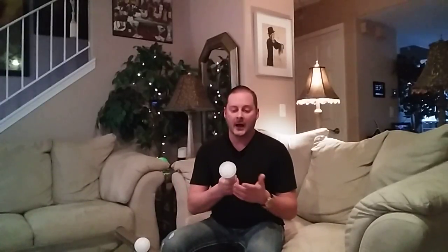One real advantage I see with the Senglid LED is that when it goes into battery power mode, the light color does not change. It just drops from 500 lumens to 300 lumens and runs three and a half hours on battery. When I tested this in a lamp, the color temperature was exactly the same — it just looked like a bulb that had been dimmed down about 60%. That was really nice on the eyes.